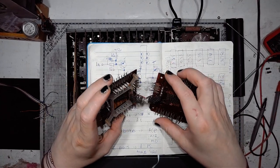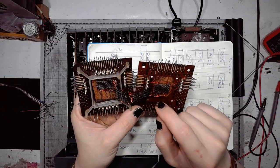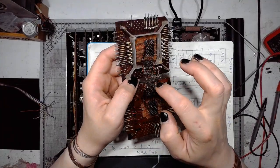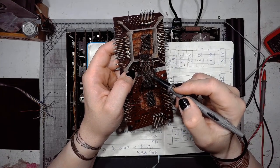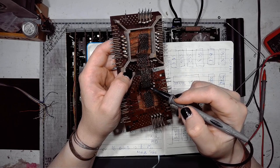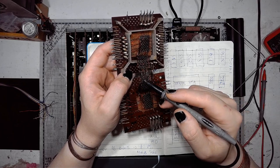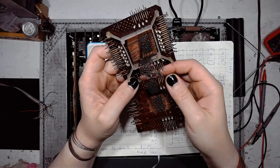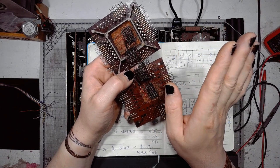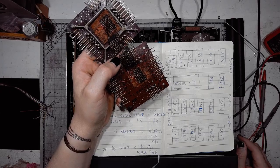But the memory organization uses six registers of two lines each. So this would be the first register. This would be the second, third, fourth, fifth, and sixth. And we've got 8 columns. Bit 0 towards 7 and 8 towards 15. Those columns and the particular bits of the register correspond to the positions on the Nixie display.